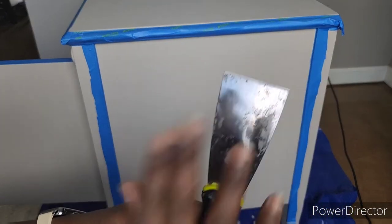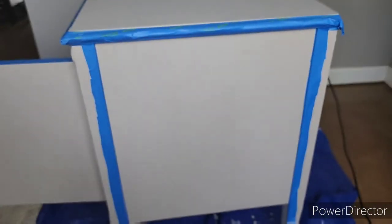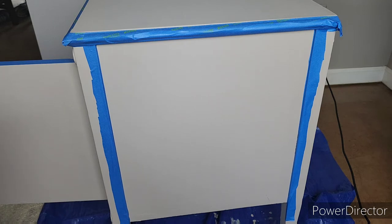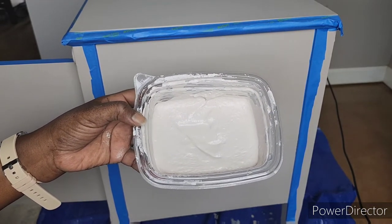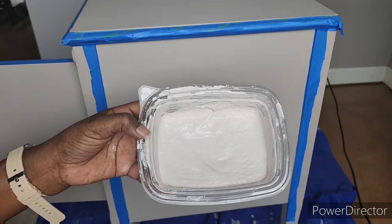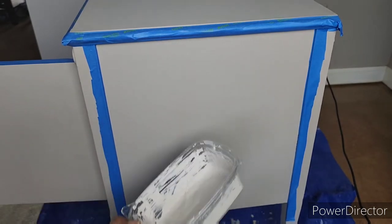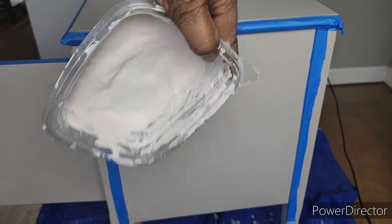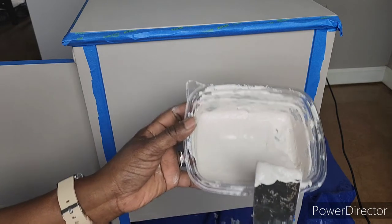The only other things you will need is a metal knife and a cloth to clean your spatula when you're finished. The color I'm using is Linen Apron milk paint by Amy Howard mixed with Venetian plaster — I use about three to four teaspoons of the plaster and about three and a half teaspoons of the paint. It's still a little runny, but we're gonna roll with it because we've got to move on.